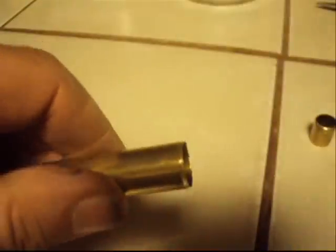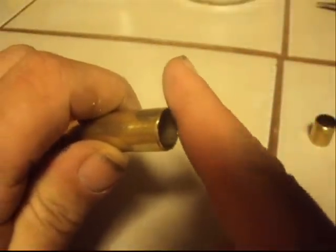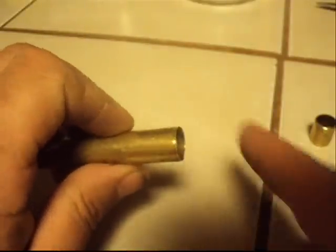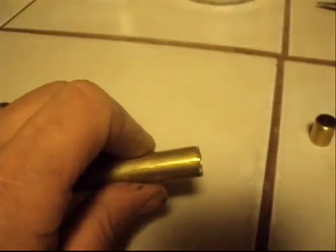The end is cut in now. All these little burrs have got to be cleaned up. On this side, when you file you want to file it out — I'm going to show you something about a file to get rid of all of this. On the outside we're going to file like this, but direction matters — there are a lot of directional properties, so I'll show you one more thing.